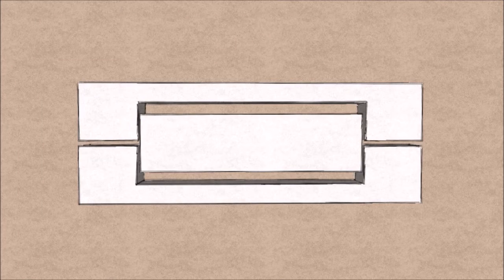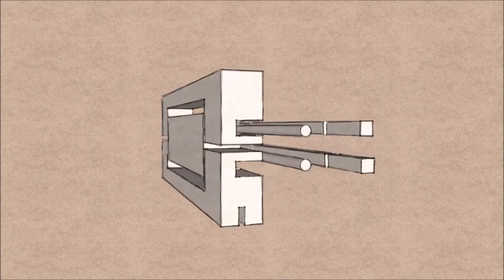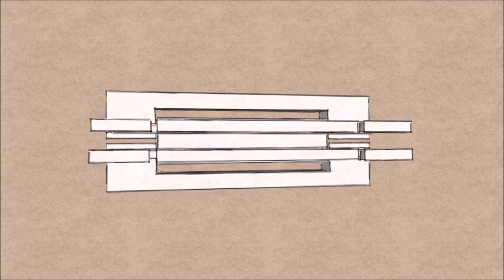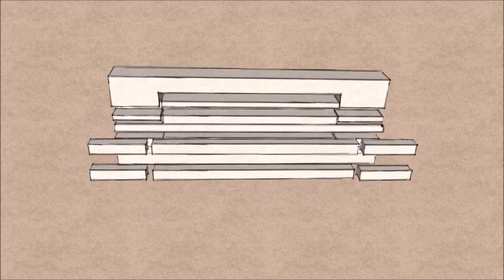The hinge is made of a top, a middle, and a bottom, all cut from 3/4 inch white pine. All three pieces are 1.5 inches wide. The top and bottom are a tad less than 9 inches long, and the middle is approximately 6 inches long.